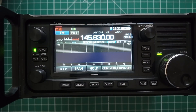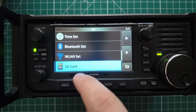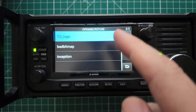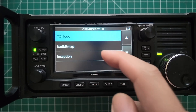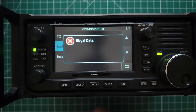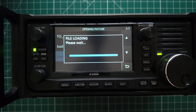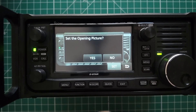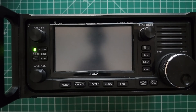Back here at the radio with the SD card put back in, I'm going to hit Menu, then Set, then scroll down until I see SD Card, and pick 'Opening Picture'. There are a couple of opening pictures on here: my logo, the bad bitmap, and the inception file. If we pick the bad bitmap file, it's going to give us an 'illegal data' error and it won't work. And then if we pick the inception file, it's going to give us the inception picture. We hit Set, it'll say 'Set the opening picture', we say Yes, and then it will reboot automatically and show you the inception picture.